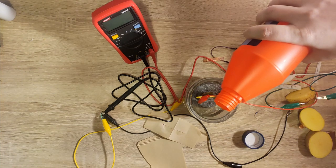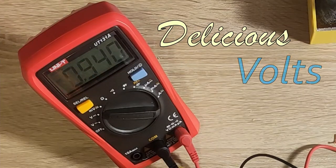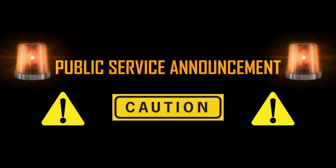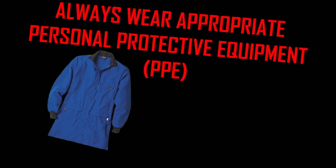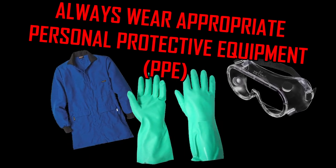So I tested the chemistry out. And indeed, you just simply take a piece of zinc, some high surface area steel, like steel wool, and submerge them in a hydroxide solution. And you will get electricity. Public service announcement. Don't be like Birdbrain. Always wear appropriate personal protective equipment, such as chemical-resistant gloves when working with strong alkali.